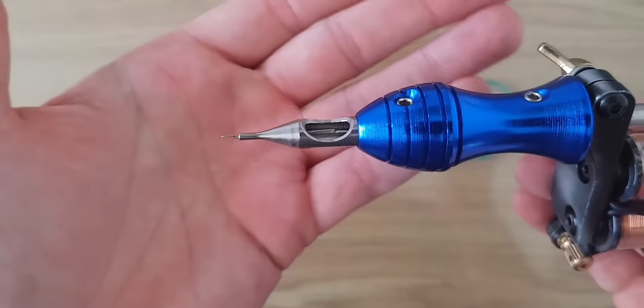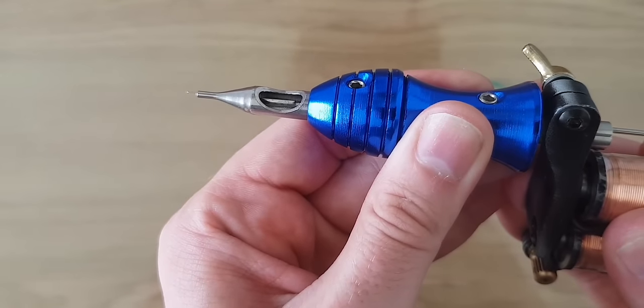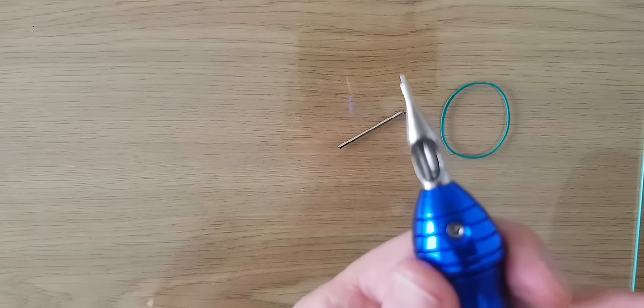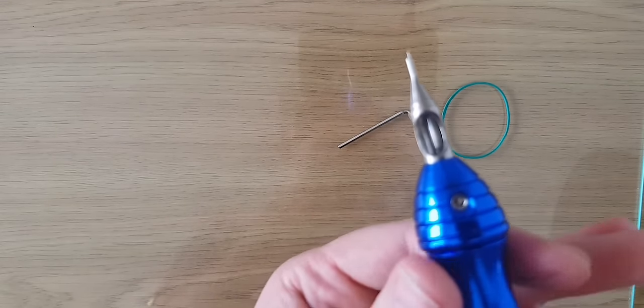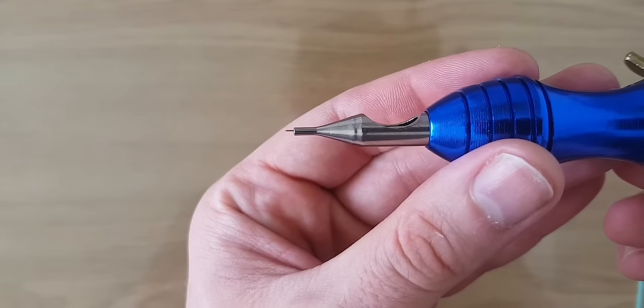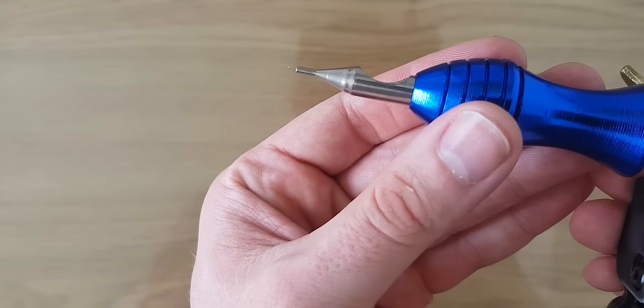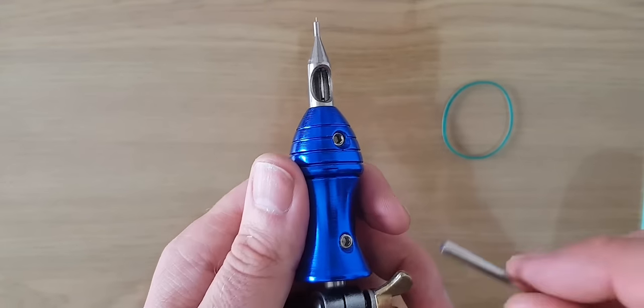As you can see here, there's too much needle sticking out, so I'm going to run that down a bit. You don't want too much needle protruding — if you were tattooing someone you don't want it popping through the skin too far, especially in fine places, because you don't want to hurt the person or cause any damage.